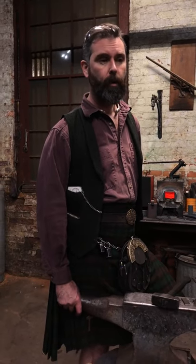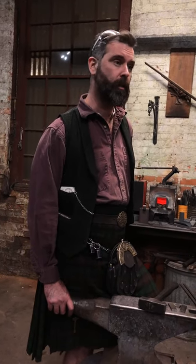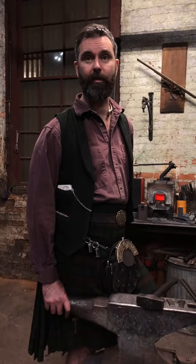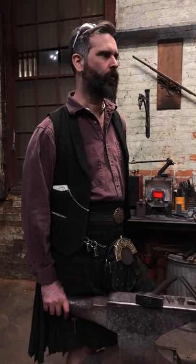But also you can go to very reputable steel manufacturers and wholesalers and get something like 5160 or some 1095 or something like that for a relatively decent price. One of the suppliers that we get steel from, I can get a 20-foot stick of 5160 quarter by 1.5 for sub $100. Man, that's a lot of knives. If you're using 6 inches of steel per knife, that's a lot of knife. So you're looking at 40 some odd, yeah, like 44 or something.